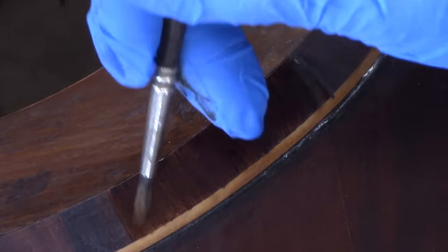All right, I think I can start the waxing process now. I'm just using some paste wax I got from the hardware store, but it has brown coloring in it. It's brown wax. There's so many little nooks and crannies and corners here that as I wax, it'll help color them up. Kind of like working like a scratch cover kind of thing. I'm also using a little steel wool here just to help clean and smooth the surface. A stencil brush helps with the corners.